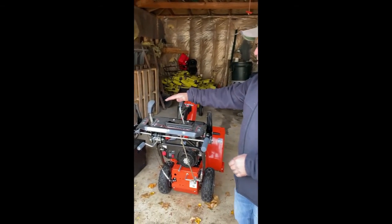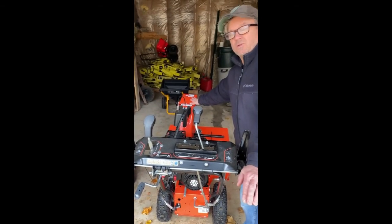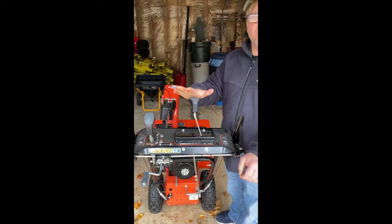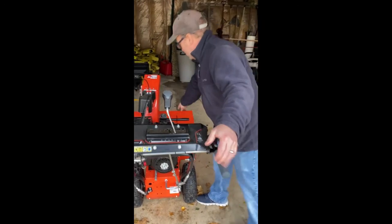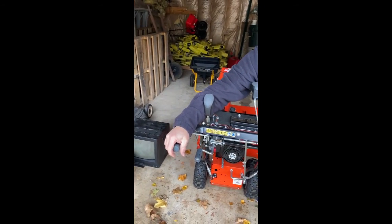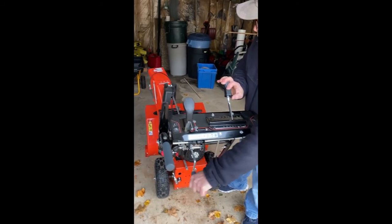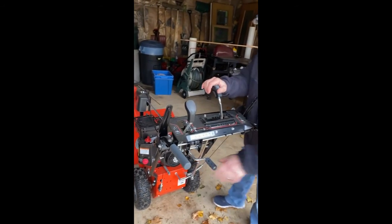When you're coming up to the controls up here, you have a controller for the pitch of the snow thrower, so you can throw it farther or, of course, throw it lower. We have speed control for forward, and then this is the auger, which is in here, which throws the snow, and this is the lever to have the machine run on self-propelled. This angles which way you're going, so I suggest you don't throw it into the street because the city doesn't like that.